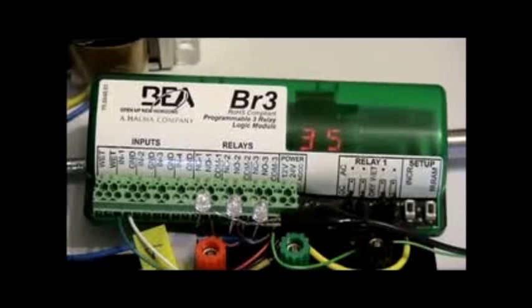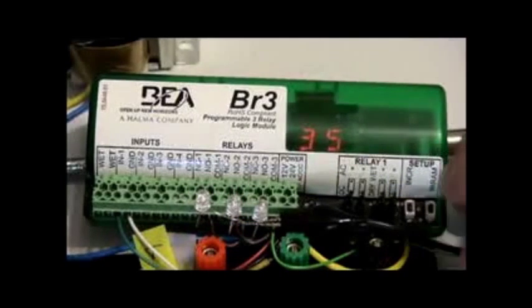There's the 35. I'll click my transmitter. Boom — two LEDs. Looks like relay 1 and relay 2 fired at the same time and relay 3 didn't do anything. Try it again — they both hold for about two seconds. Why is that? Well, let's go see.